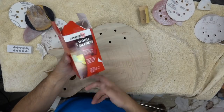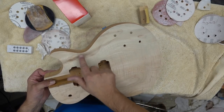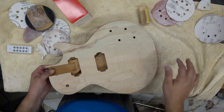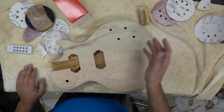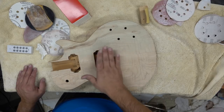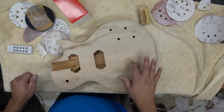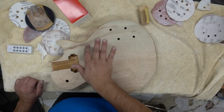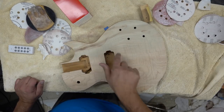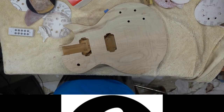So this is two applications of Zinsser wood bleach and it came out really nice — really lightened. When I do my feathering I'll leave this a little bit darker. Next steps: we'll put on some binding and get ready for the coloring. When I do the coloring I'll put a really heavy dark coat and then sand that back, which should really even out the top even though I used bleach on this one side. That way when I'm doing my fades I'll get some really cool color to blend in. Thanks for watching guys, we'll see you in the next video.